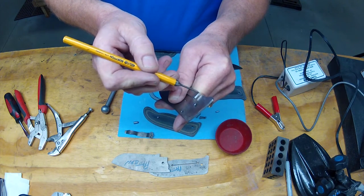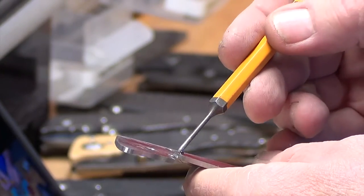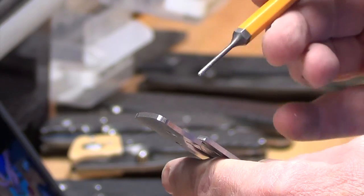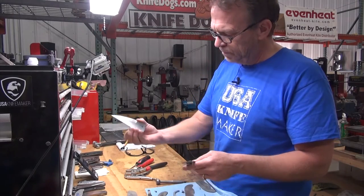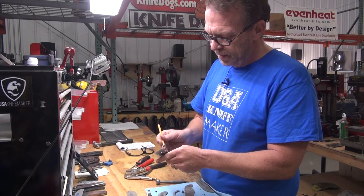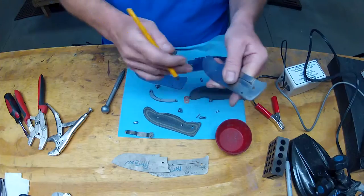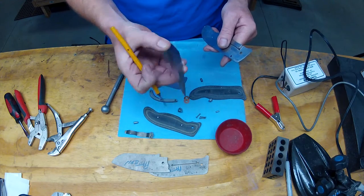I've never been able to save one, but I have been able to tighten some up with just a lot of time on there. You can cook this lock face, take it up to cherry red, let it cool off, cycle that three or four times and you'll harden that face. The benefit is you get titanium going against steel, which tends to gall and grab. When you carbidize it, you're getting a 70 Rockwell face with tungsten carbide — just under diamond hardness — so that helps reduce wear. This blade is around 61.5–62 Rockwell, M390, pretty hard stuff.